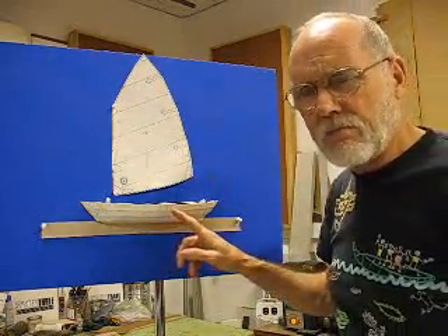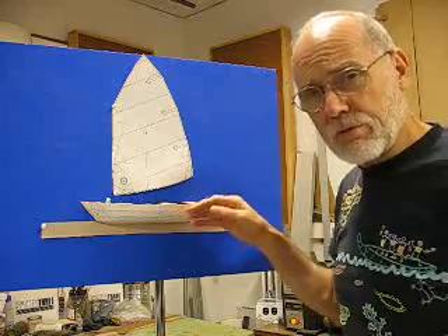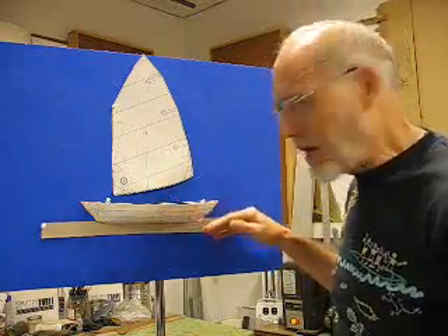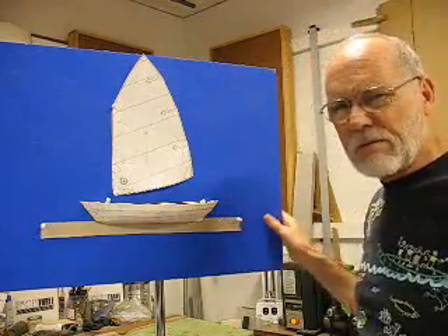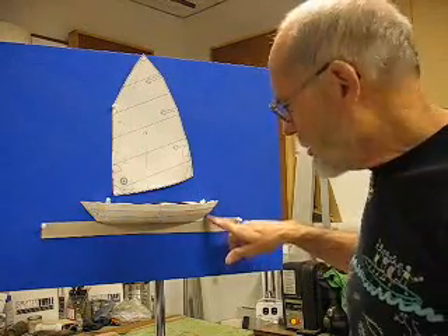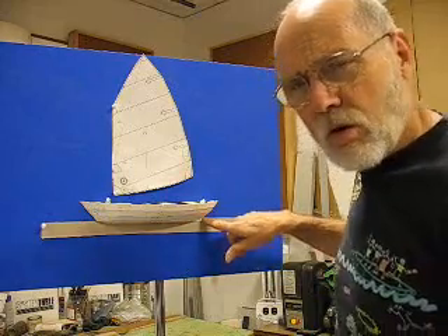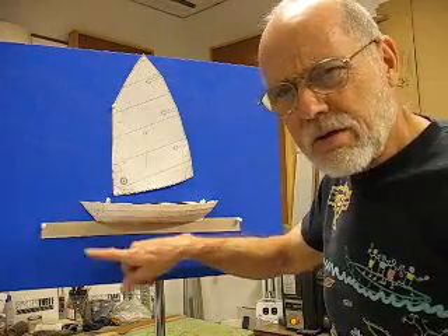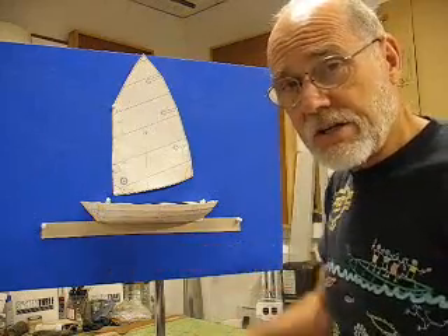I've got my half hull from one of the models — one of the last, maybe second to last, models I cut in half. Sometimes that's a little pain to get the hull to come out the right shape. I've also got an artificial horizon here which is my waterline. We know from the last video that when the boat is sitting at rest without anybody in it, the aft waterline was where the V touches the water, and the front waterline of the hull was where the two panels up here come together. I've got that set in.